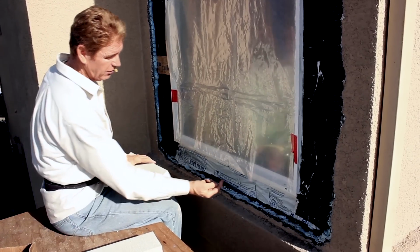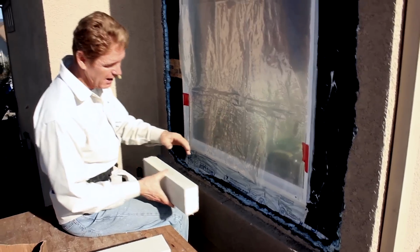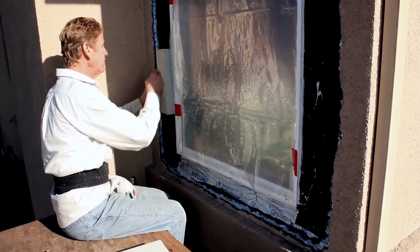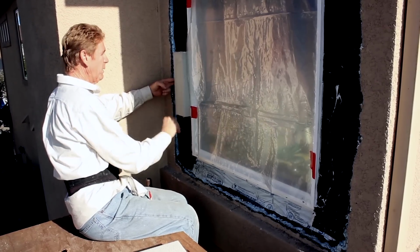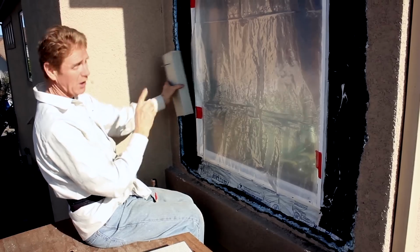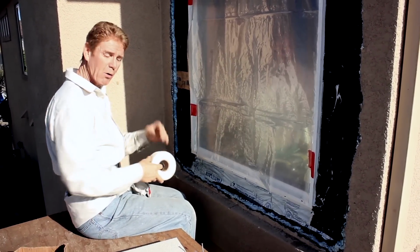Then I'm going to use a polyurethane. It's just an adhesive caulking, and I'm going to put it all around in the window frame because these molds go on the adhesive caulking. It gets adhered much better. Then we put some nails through this stuff, stick it in there, and coat that with a poly bond. We coat the exterior with fibers. When we get to that stage, we'll show you.